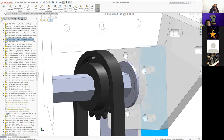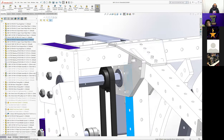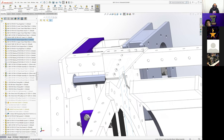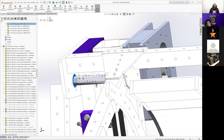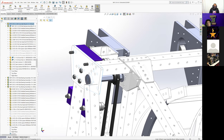All right, that would be bad. So you have a 3/8 bearing there, and the issue is if you do what we would normally do and put a bearing with the flange on the inside here, there's no real way to take this apart ever without taking off this entire side plate, which we really didn't want to do.